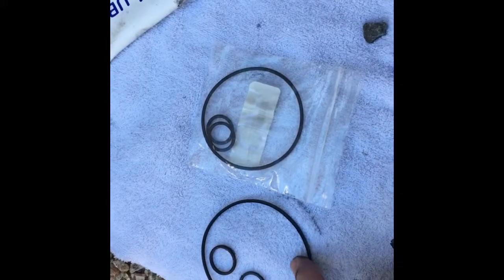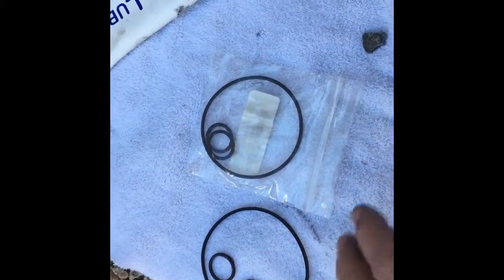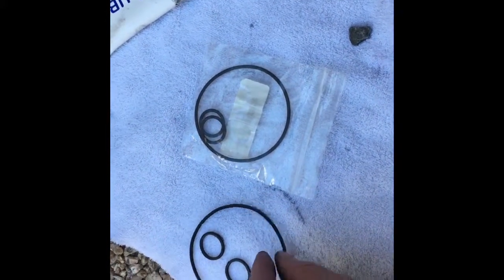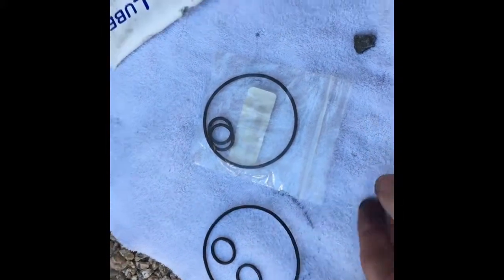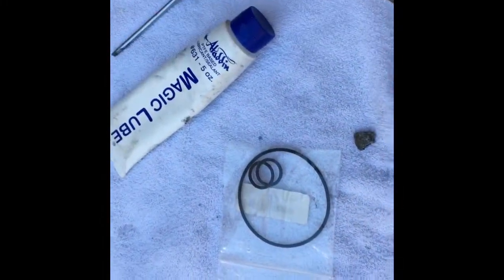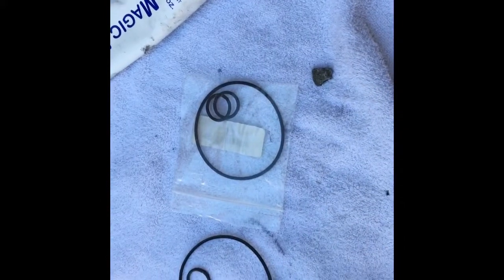Here's the old versus new O-ring set. These are the old ones that were just removed — they're greasy and dirty because they're starting to deteriorate; they're also not very flexible, almost brittle. For the new O-ring set, take your O-ring lube and grease them up real good.